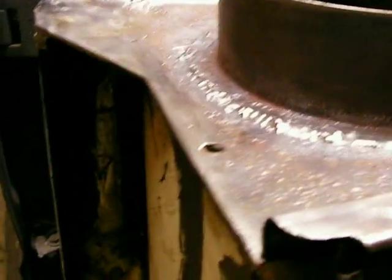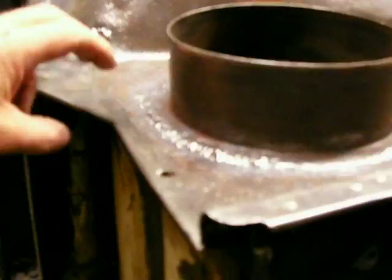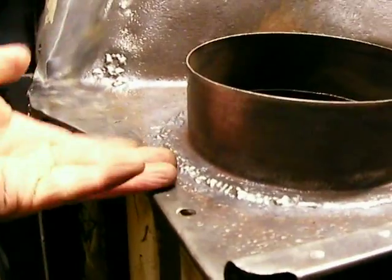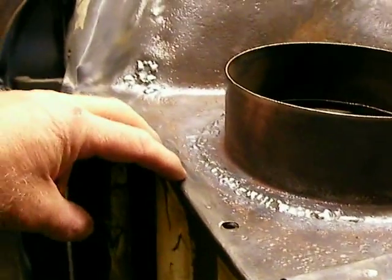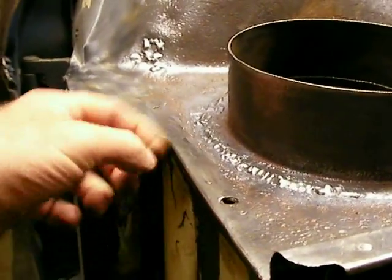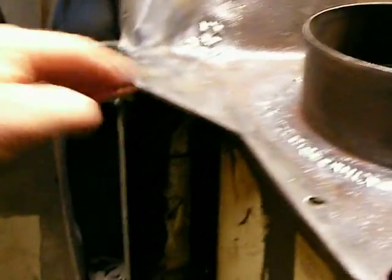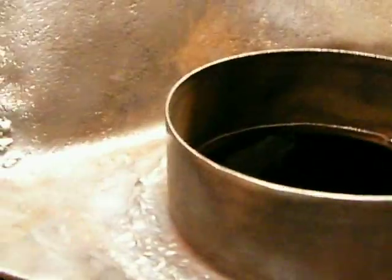On the ends right here, this is also a concern from the factory. I believe it's raw steel in between these two layers, and on the end here it's just got the fold and then the spot weld, and water can get under here and do a lot of rust damage. That's what you're looking at when you take the thing apart.